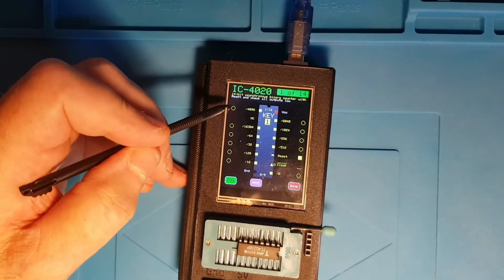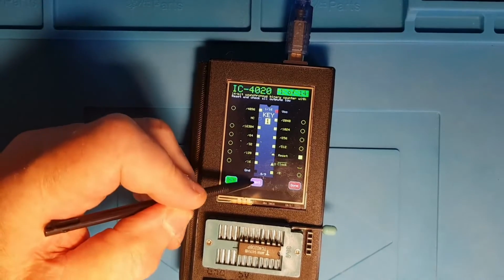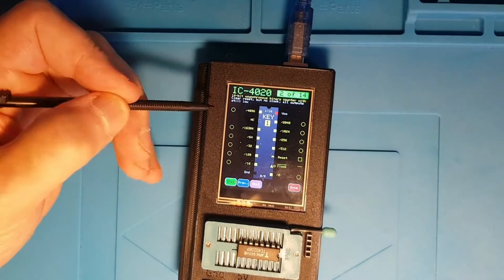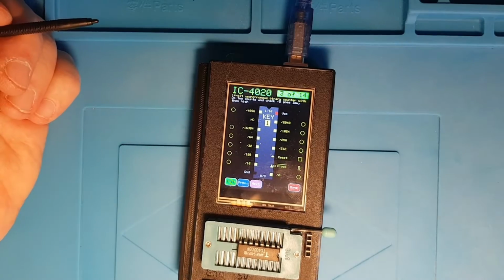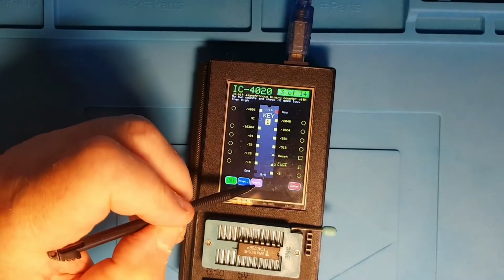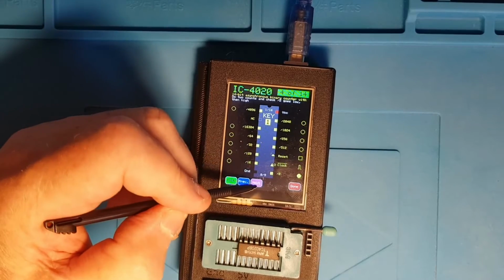So at the moment, we've got all the different divide options which show what the count's doing, and if we do a test, it's going to say, right, so we're going to reset, check all outputs low, then we're going to clear the reset but not do a clock, all outputs should still stay low, which they have. So then I'm going to do 2 counts and check that the divide by 2 goes low, which it has. So then I'm going to do 2 more counts and check that it goes low and then high, which it did.